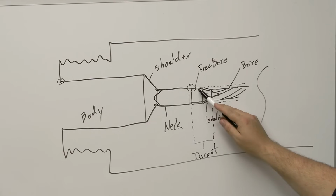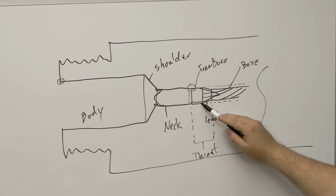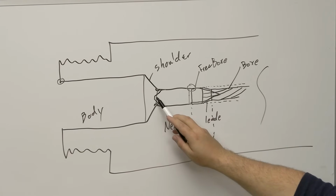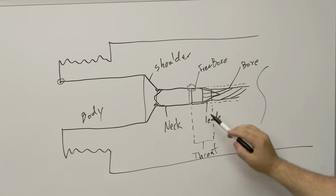That's why those comparator bushings that Scott mentioned before are something less than the nominal bullet diameter. If that's a 284 bullet, a 7mm bullet, the bushing that's going to contact the ogive is going to be nominally less than 284, so that it ensures that it's measuring from this curved surface to the base of the case, and not anything else. So learning what the important datums are, and measuring to them.